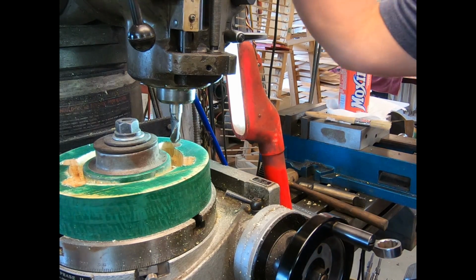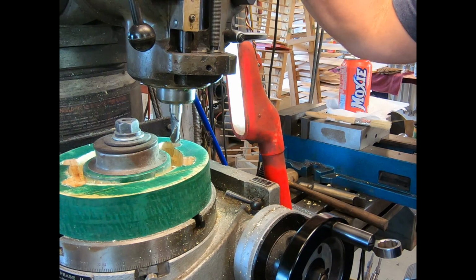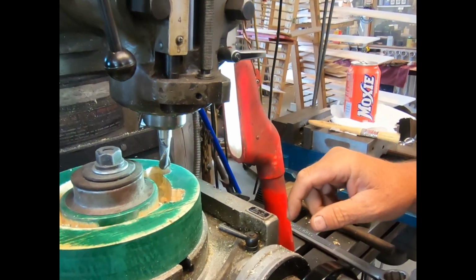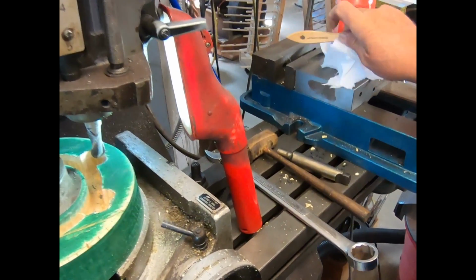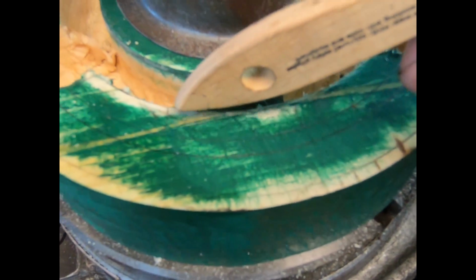Well, everybody, we've got the milling cutter angled the other way to keep our draft right. So now, I don't know if you can see it, but right at the end of that, you can see that line right there. This is what we're going to. We've got one here. Well, we're not going to do in here, although I do have to come over and match that edge to get the draft right. We're not going to cut this slot out. This area here is going to be for the decompression.